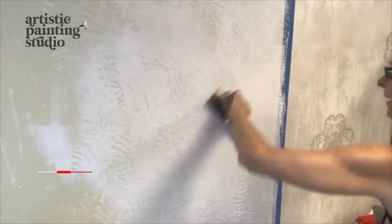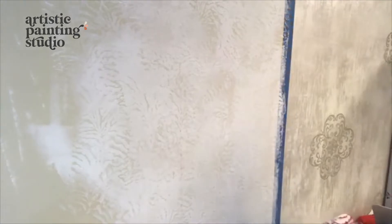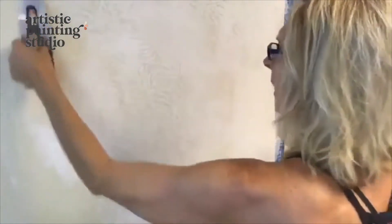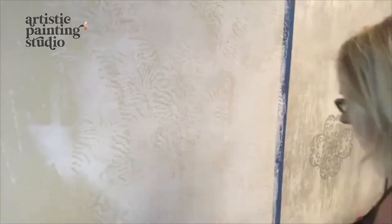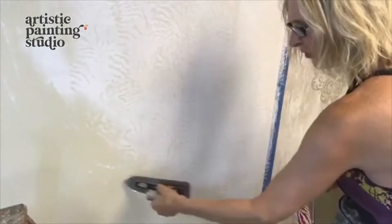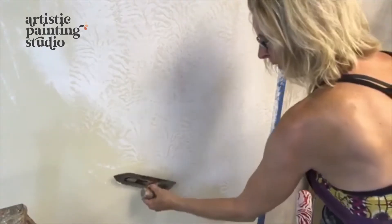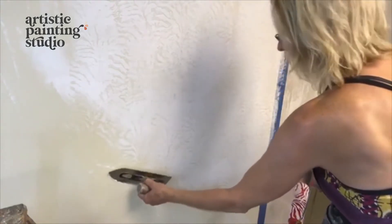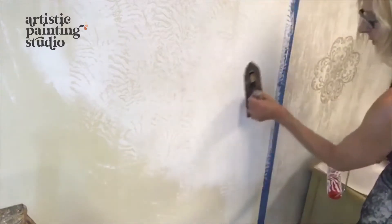If by chance I did flatten out a lot, how simple is it — I just come back and add a little bit more pattern there and now I have more interest. I always want to get out into open land where there's no texture so that I don't put a trowel mark in the middle of something, and feather in to my work.